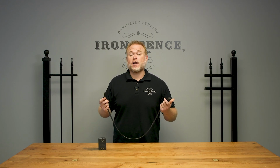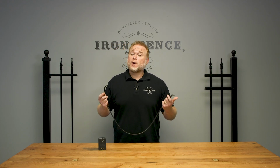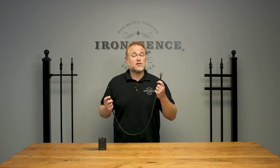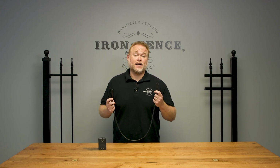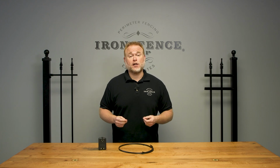It's often labeled or described as low voltage landscape wiring that can be buried directly in ground. Direct bury wire means it doesn't need to be buried in conduit, but it will help it last longer and avoid getting cut or split by shoveling around the line if you do use that conduit. So that's what comes with the Ghost Controls DEP2 decorative double gate kit, and what you'll need beyond it to get your gate opening and closing.